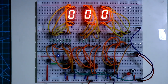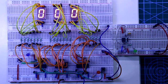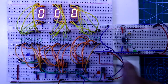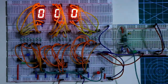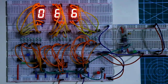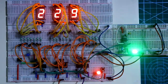For automatic counting, you can connect a pulse generating circuit to this circuit — like one using a 555 IC. I have already explained this circuit in another video, linked in the description below. Connect the power supply to that circuit: negative to negative rail and positive to positive rail. The output pin of the 555 IC is pin number 3, so pin number 3 of the 555 IC should be connected to pin number 1 of the first 4026 IC. This is how the counter works, and it will count up to 999.